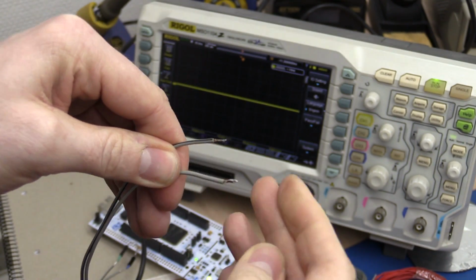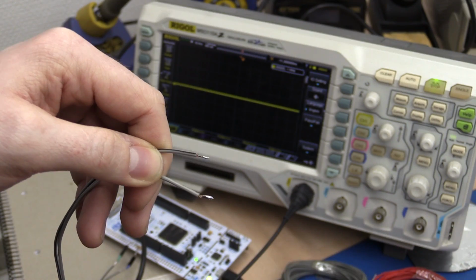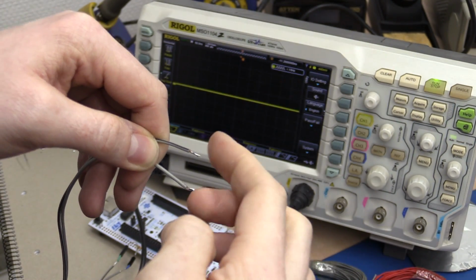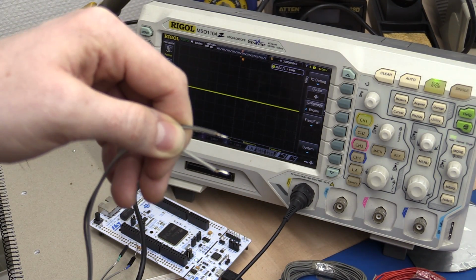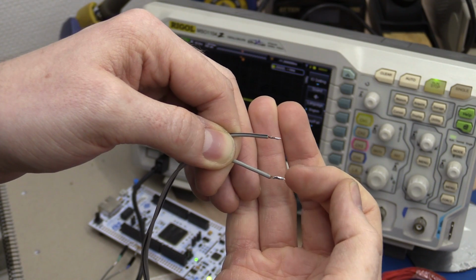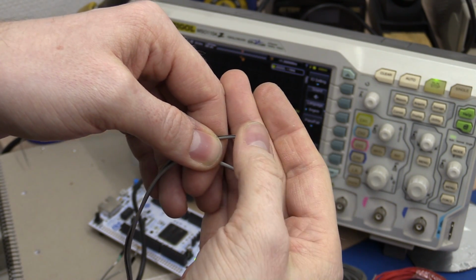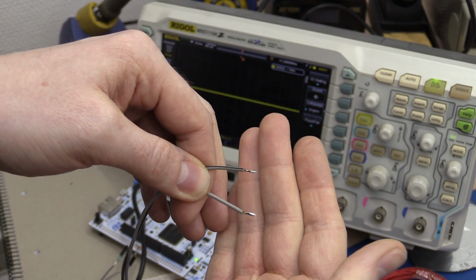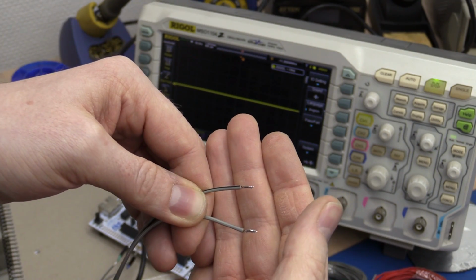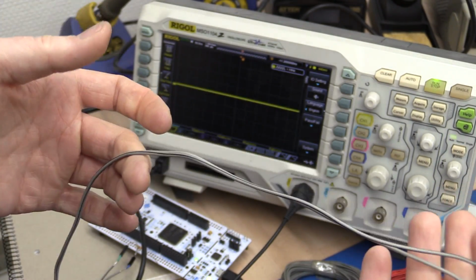So far we have used this cable with nothing connected at the other end, and that would be a typical scenario for a receiver to have a very, very high input impedance, just measuring the voltage across the two wires, like if you use a multimeter. But what we can do is put a load across here, just a resistor, and this load we would call a termination resistor. And so you might ask, which resistor do we use? And actually there's only one thing that determines that, and that's the cable.